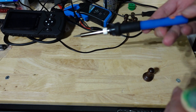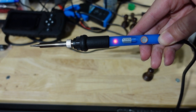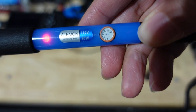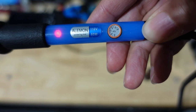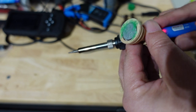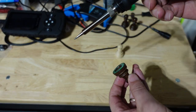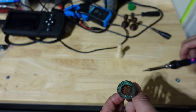So how did I get these out without cracking or breaking anything? I have a soldering iron right here. You can buy a soldering iron like this cheap on Amazon - for like 10 bucks. This thing is set at 350 degrees. Basically you just take the soldering iron and lay it right across the thing and heat it up.